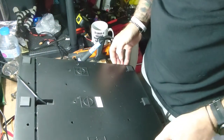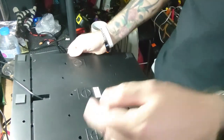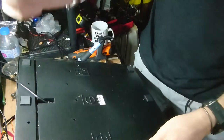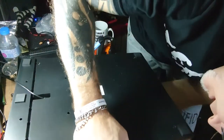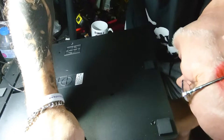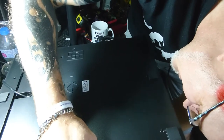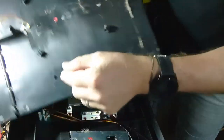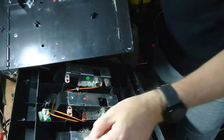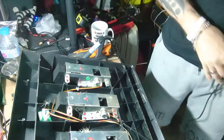Okay, we should be able to get some wire now. Bingo. Now under here there's a plug attached to this that you can just unplug. You don't have to damage any wires or anything. There we go. That's it, it's just that plug goes into that socket there, and it can only go in one way, so when you're putting it back you don't have to worry. So we can put that to one side for now,